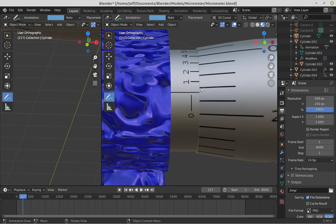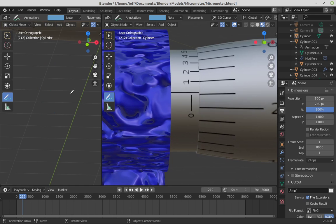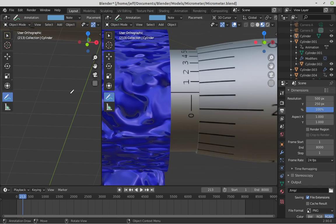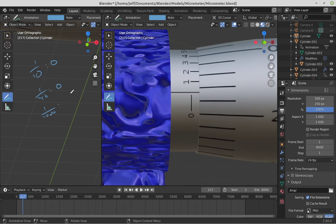The other readings are both zeros. 1/10th of an inch, the reading was a 0. 1/40th of an inch, the reading was a 0. But once I get to the thousandth scale, I can't tell which one of those is lined up. I think it's right there. That would be 21 thousandths. I guess they're both 21 thousandths, aren't they? 21 thousandths, which is, no, it's not 0.0021. It's just 0.021. And 1/10,000th of an inch. At the 10,000ths of an inch scale, we're talking about a difference between 0 or I think I said 7. I don't even remember what it was at this point.